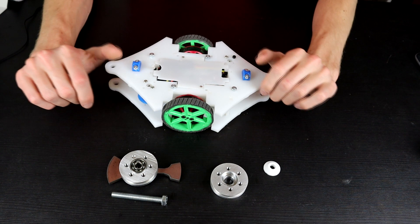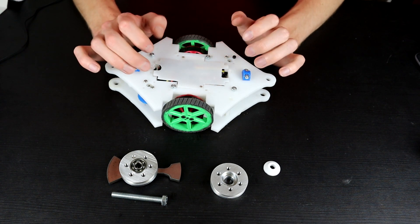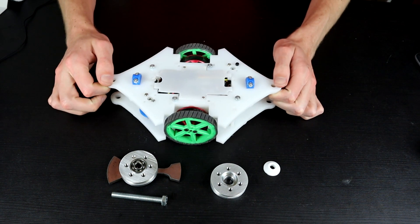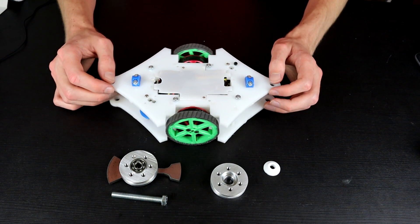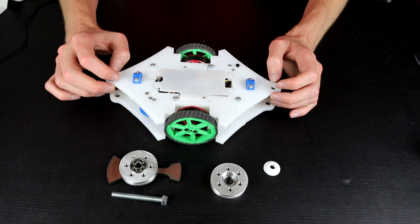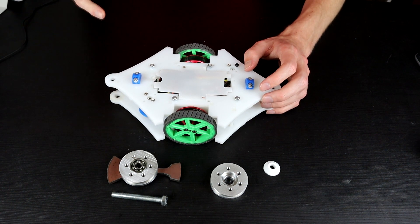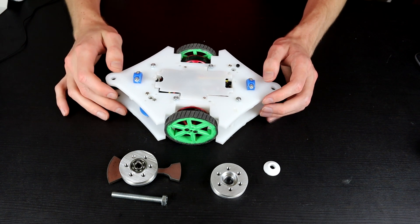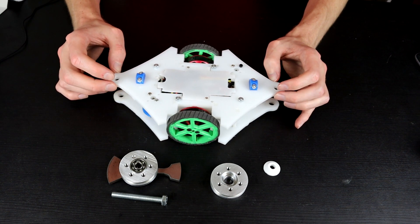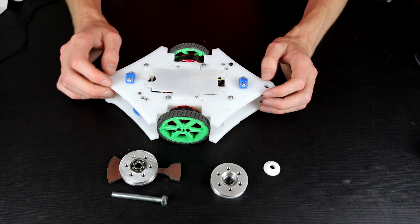So this is as good as it's going to get for now. I should have coded up DSHOT but just didn't have time. Instead, I'm running a very reduced frame for the servo pulses and it works — it's actually more responsive. I'm annoyed because I didn't have audio in any of my test footage in this video, which sucks because some of the interesting stuff with this melty — the speeding up and slowing down as it tries to translate — you can really hear it more than you can see it. Anyway, it now works on slightly reduced servo pulses and seems to have more control. The meltying works a little bit better. It's not perfect, and there's a lot I could change and upgrade.